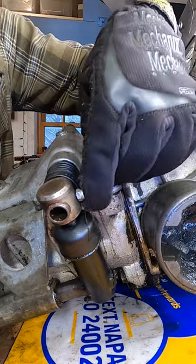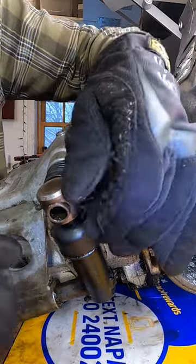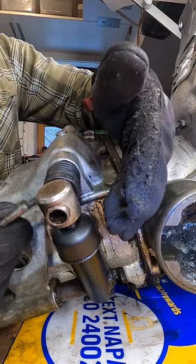It's retained by the nut being on the small side of the cone. But if you want to take it out, you can take that nut off, put it on the large side of the cone, and it acts as its own press to pull this cone out.